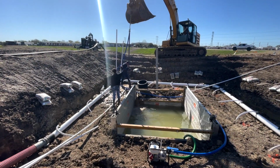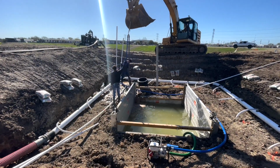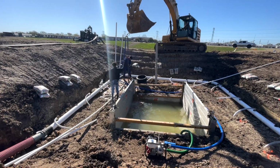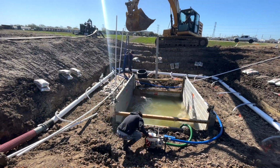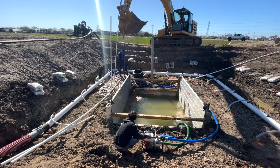Now when you're jetting these in, you want to end up into your sand. Look at your soil report and it's going to show you the layer in the clay. You want it to be in the sand. Don't want to leave the tip of it. It won't draw if it's not in that water vein sand. You may have to go a little deeper than you want to hit that.